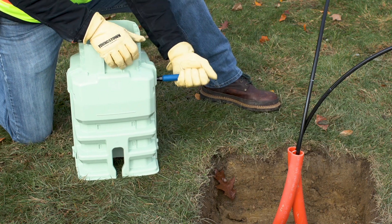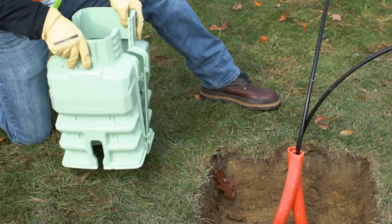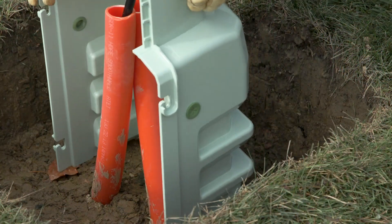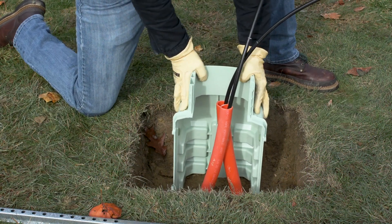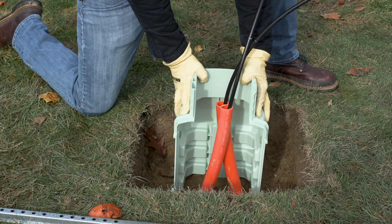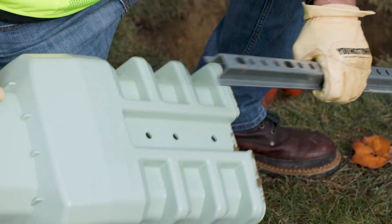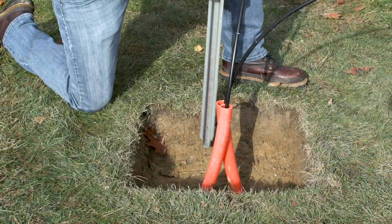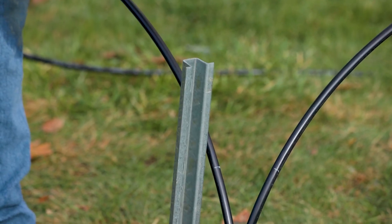The split base can be separated by loosening the bolts on each side of the base a couple of turns to separate the base halves, then lift the front half away from the rear half. Using the back half of the base, create an impression in the trench to determine the position of the anchor stake. For harder ground, use a tool to mark the location. The base should be installed so that existing conduit or feed cables are towards the rear. The anchor stake attaches to the rear with its flat edge in the stake channel. Install the anchor stake into the trench following your standard company practices, ensuring it is level.